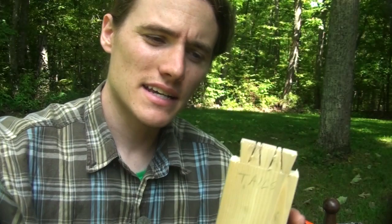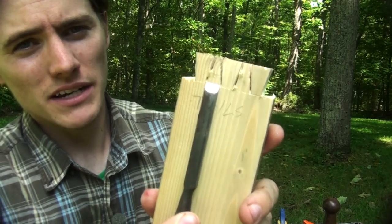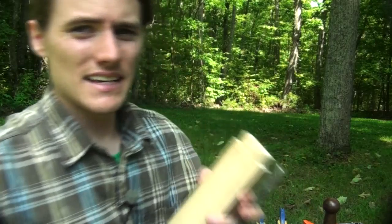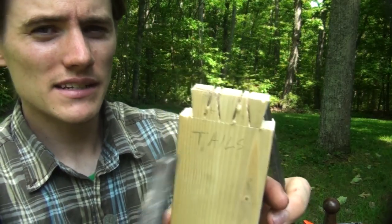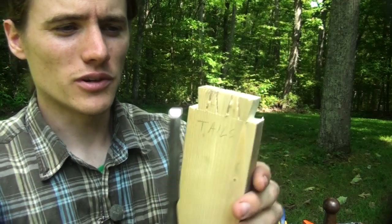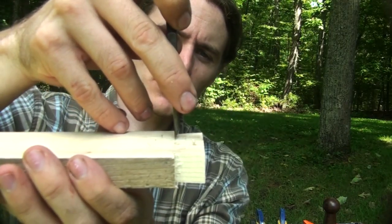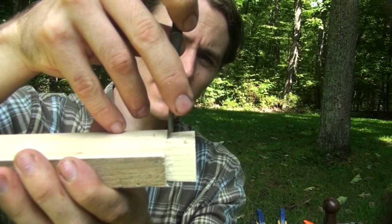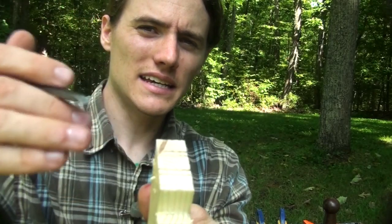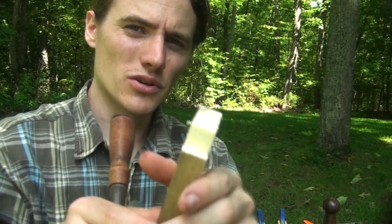Once you've got your angles cut, the next step is chiseling out the waste material between your dovetails. Take a chisel and compare it to the bottom of the pin area and choose one that's narrower, because if you use one that's the exact width, the corners of the chisel will mar the edges of each tail. Also, rather than going vertical, tilt the chisel in slightly so the only contact at the board is a little bit at each edge, with the middle being slightly concave — this keeps the joint from lumping up and makes for a tighter-looking joint.